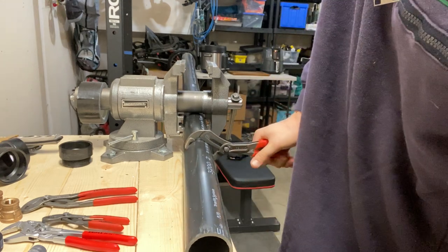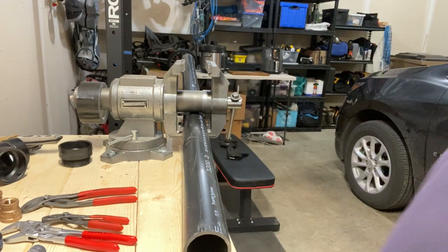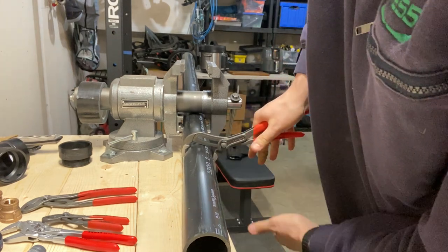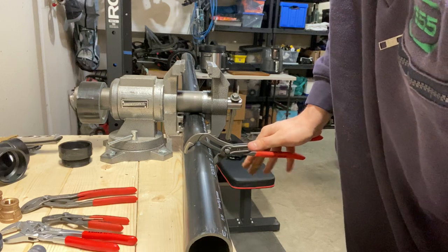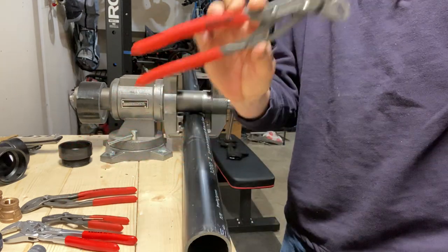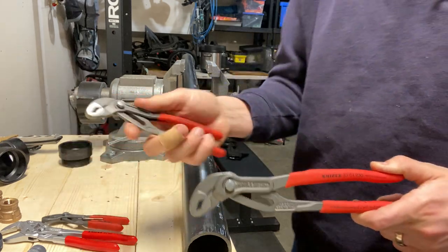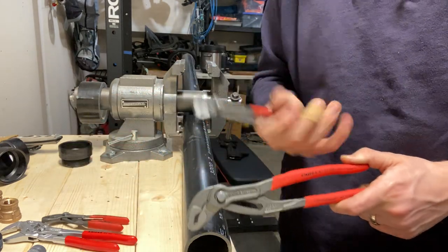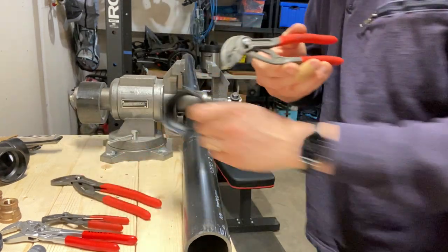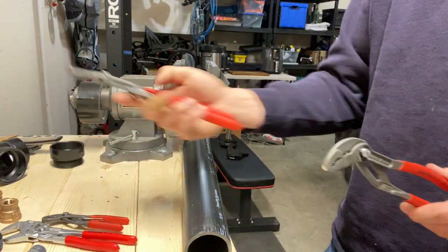There you go — see how I can dig in. Once you get dug into that, see how it bites. If you want to do two inch straight pipe you're going to need the 250s, but the 180s will get you out of a lot of trouble, especially up to inch and a half for sure. You can make the 180s do things with two inch pipe, but I really recommend going up to the 250s.